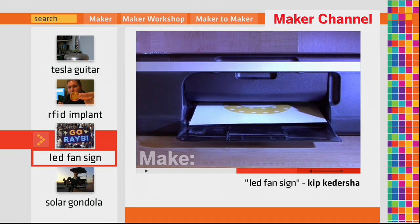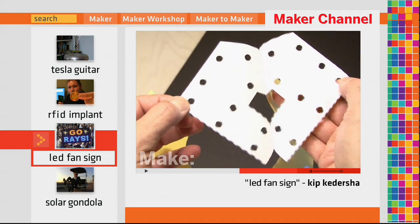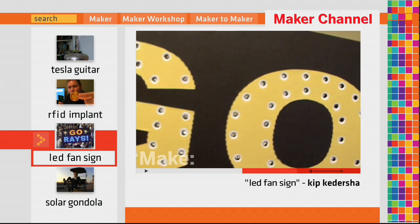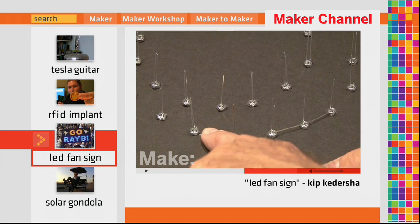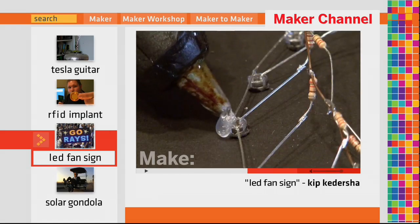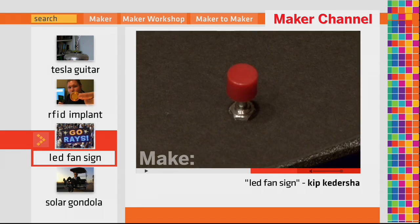I printed each letter on a single sheet of sticker paper and cut out each letter. I used a hole punch for where each LED would go. Then laying out the 3/16 inch foam core, peel the sticker paper and lay out the letters. The best way to make holes was to use a soldering iron — it was the exact size of a 5-millimeter LED. LEDs go in each hole, negative connections are joined together, and a 330-ohm resistor is attached to each positive end, then all positive ends are connected together. Using 1-inch rubber stoppers, I hot glued those to the base of the foam core, then used pieces of foam core to cover everything up, along with a place for the on-off switch.